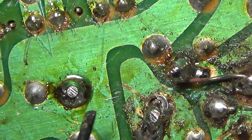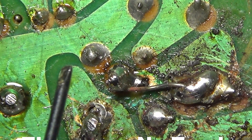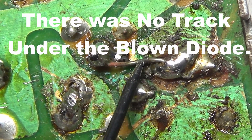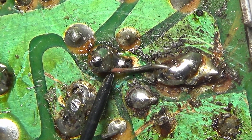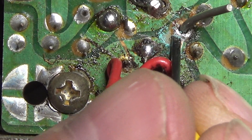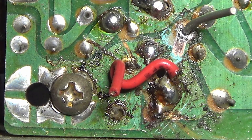Okay, this is a close-up of the repair that I've done. This is one end of the diode and this is the other - that's about as good as I can show it. Here is the 12 volt positive end that I had to solder in and here is the wire. I've cleaned up some of the tracking here and I'm going to try and solder that diode straight in.